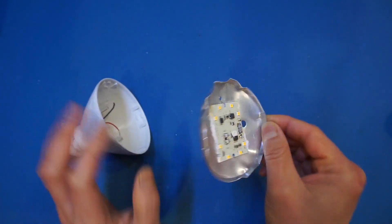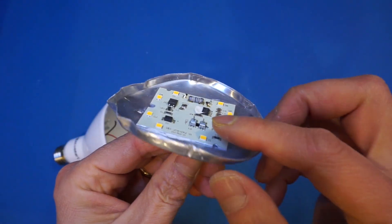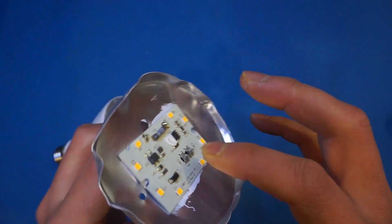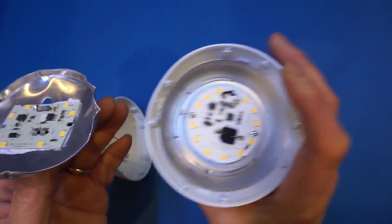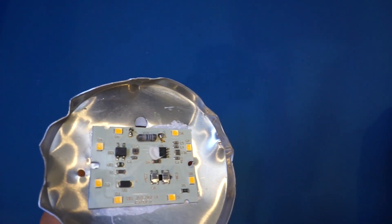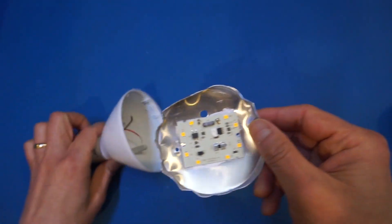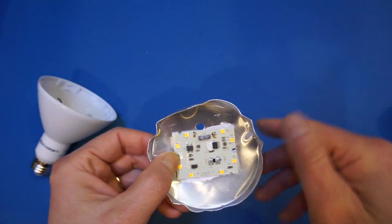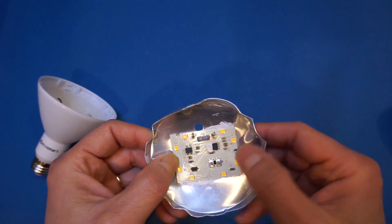On the reverse side there is a cap. Interestingly, especially on this 65-watt version, you can see that the cap is actually not soldered on — presumably this is for increasing reliability. These are actually crimped on, you can see this angle. On the 75-watt version, this capacitor is soldered onto the board directly. This design is quite clever, as this piece of aluminum serves as a heat sink, with heat dissipated through the aluminum casing without transferring to the capacitor, which increases the lifespan of the capacitor.